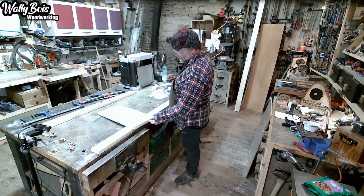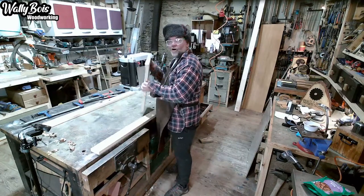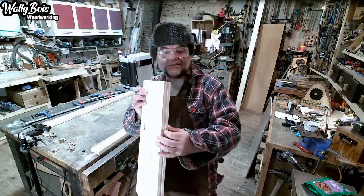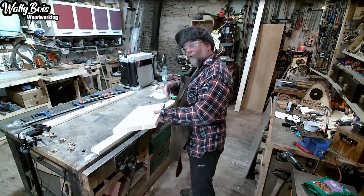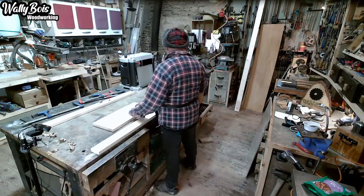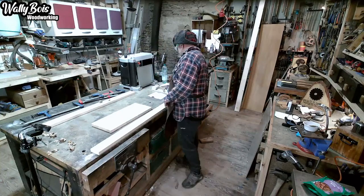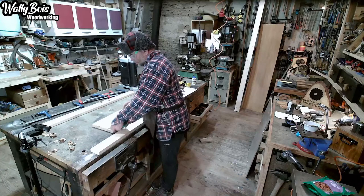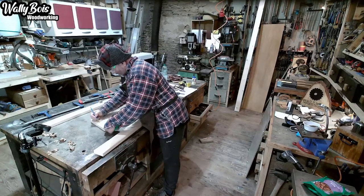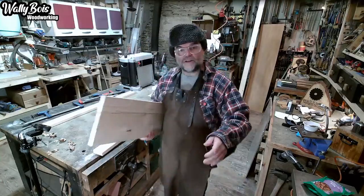Usually I put in a bit of hardwood. Basically have a groove on each face, and then a little join in between, just a hardwood slip normally. That stops water penetration. But we don't need to because it's inside, so I'm not going to worry. If I was doing it for somebody else, maybe I would be more concerned, but it's in my house.